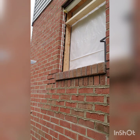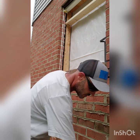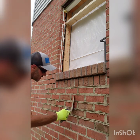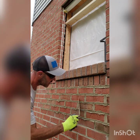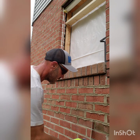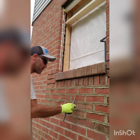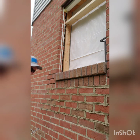So that's basically it. I'm going to let this set for a while and come back, probably take my duck tail or something and scrape some of this excess off. It's going to kind of fill in the little holes around it and the little line that you created, but that's why I'll run back over this again. I'll let this set up a little bit, because these edges of the mortar that are going to come off — when they get hard enough, the chances of smearing on the brick are lessened pretty dramatically. So that's basically it — that's Tuck Pointing 101. To all you haters out there dissing me for calling using a grout bag tuck pointing — well, there you go. Now you can tuck point. Peace.